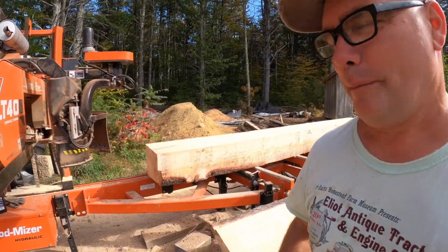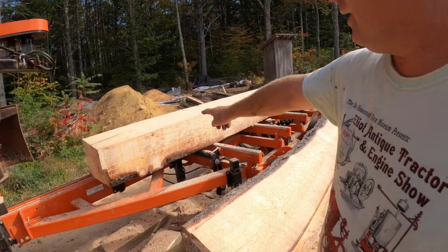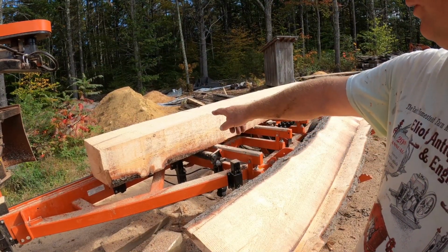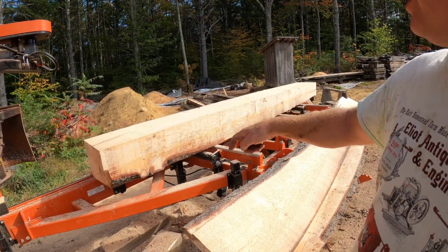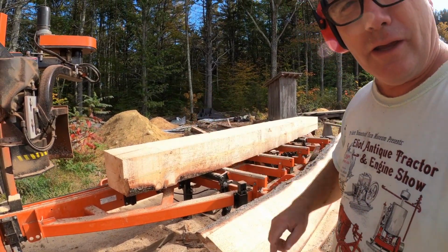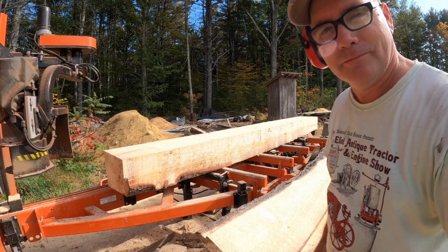All right, just about out of battery, but you can see I got the slabs off. I can get 2 2x6s out of those, which is excellent. And that ended up being 12 1/8, and I took a cut down the middle, which is 1/8 inch kerf. So those are 2 6-inch by whatever they are. The next thing I'm going to do is flip them up on their edge, flip them 90 degrees, and use the 8/4 scale on the sawmill, and just cut all of those up into 2x6s. That's the next step.